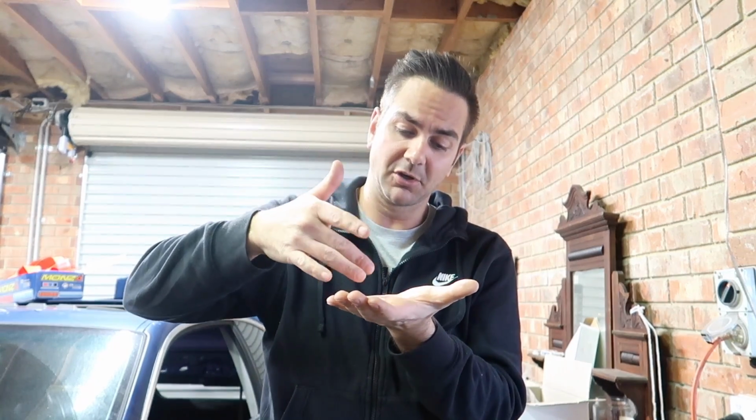Another thing that I've noticed is that the torch needs to be basically pointing straight up and down from the material. I think you can have it on a little bit of an angle, but on too much of an angle, it just doesn't pull. I noticed myself going on a bit of an angle like I would if I was MIG welding and pushing along like that, but you've really got to be straight up and down, nice and vertical, for that tungsten to actually be burning into the steel, and for the arc to be working efficiently.